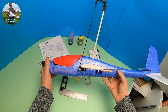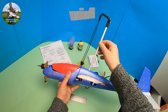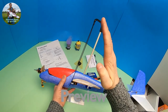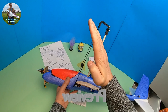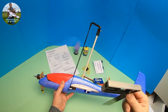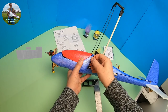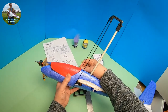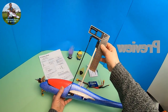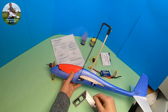The reason why the mast is angled back is so that when it's flying through the air, as the blades are being dragged through, they will windmill — they'll rotate at an angle, okay, not flat. You set the head up at about 90 degrees to that. Obviously we can alter that — these are only temporary at the moment while I show you — so we're looking at it being set up at 90 degrees initially.